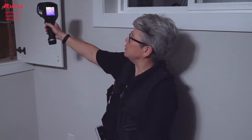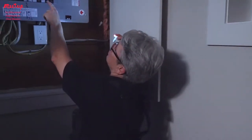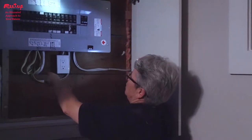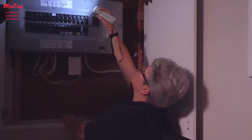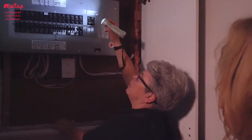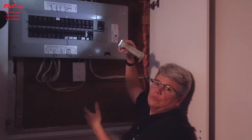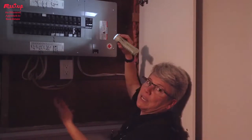The electrical panel is a very important feature to look for. We're looking at the age and condition of the wiring, and the type of wiring. This is brand new wiring. The green cloth-wrapped stuff is probably original wiring. This house is not old enough to have knob-and-tube wiring, which is the 1940s and earlier ungrounded type.